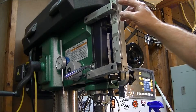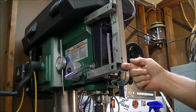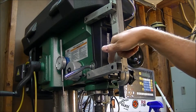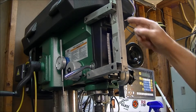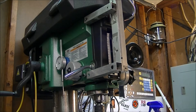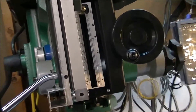All right, let's go work on the mill. This is kind of like an unfinished job here. It looks pretty solid and it feels pretty solid, but it's actually got a joint that could move. So I got some aluminum rods that I can braze this with to make it pretty well solid. The main goal is that I won't let it get misaligned. I'll move this around and zoom in so you can see what I'm talking about.